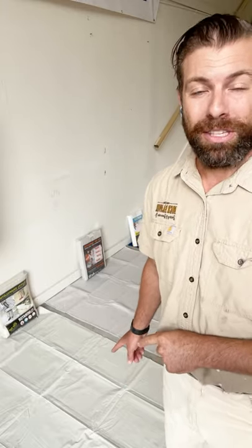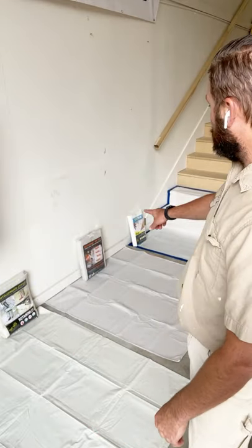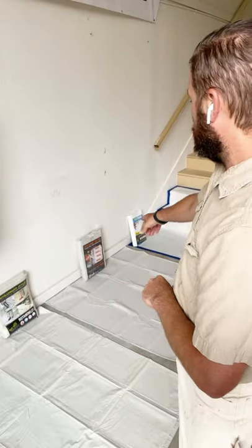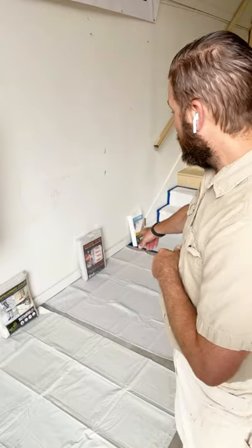One of the biggest items in safety training is simple anti-slip protection. We now have specific safety training: when on a roof, using StayPut or butyl with anti-slip backing, the weight holds it down on the roof. The StayPut is wonderful because we don't want to mar shingles — even on a super grippy asphalt shingle, a layer of canvas can shoot out from under you. When you add anti-slip protection, you get the benefit of a drop cloth plus anti-slip. Roofs are a huge application.